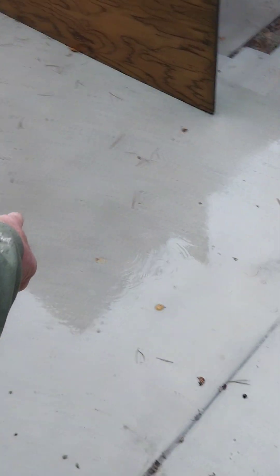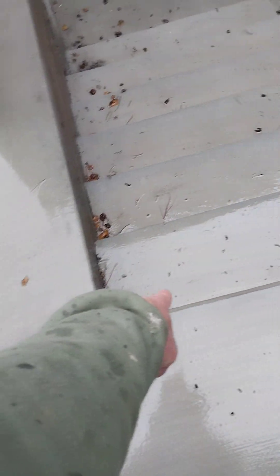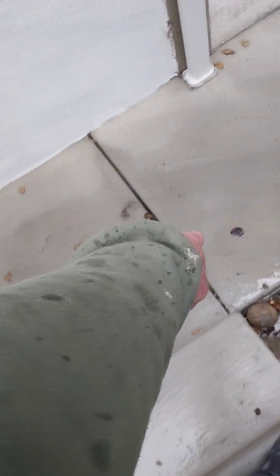These are my highest swales on the property in the backyard, and you can see that all the runoff from this hardscape is going to move down into that swale trench. All my hardscape runoff is coming from all the way up there, and the hard pan is allowing the water to build up and then it flows down here. What doesn't flow down here gets diverted by this little expansion joint and comes down these steps into here. I'm going to need to put more sand in this location because water travels downhill all the way to my swales and then off the property in that far corner.